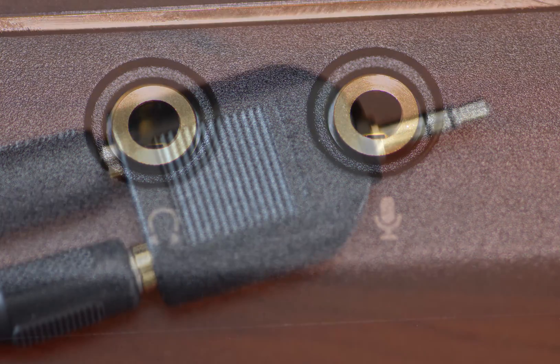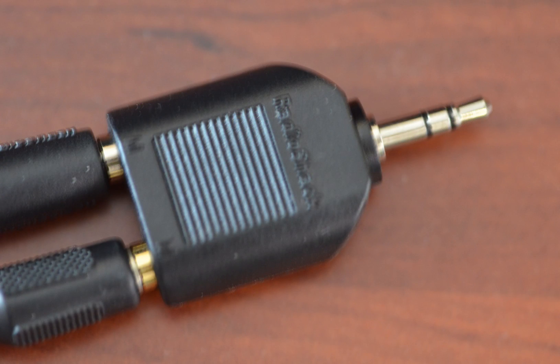Make certain that you use the microphone input. Because you have to combine both cables coming from the LPPan2 into one input on the modem, you will have to use an adapter similar to this. The adapter you use may not have left and right designated — if it doesn't, just switch the cables back and forth. You will be able to see which is correct by watching the display on the software.